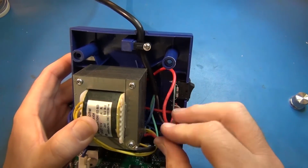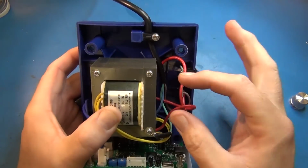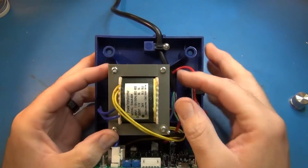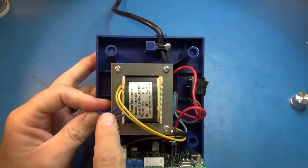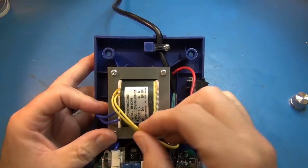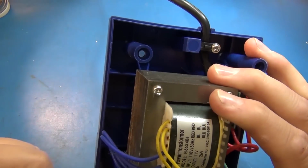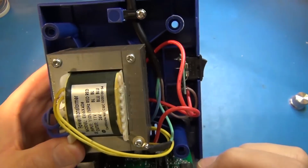That's funny. And then they both go to red because the two sides of the bottom of the transformer is for the mains, and then it looks like a fairly decent main transformer. It's decent size. It's got 2 outputs, so there's 2 taps. There's going to be a 26 volt tap coming out of the blue, and something slightly smaller for the yellow. Judging by what's going on here, you got the 26 volts coming up to the top, where it's controlling it with that. Looks like it'll be a Triac in there again.